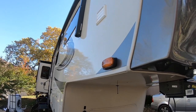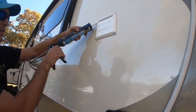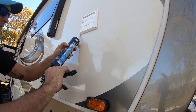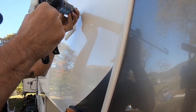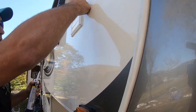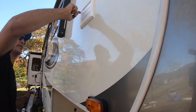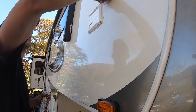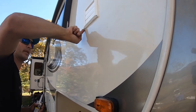We've now secured the outside flange with the four pan head screws. I'm going to take the silicone and run a nice small, about an eighth inch bead all the way around the exterior of the flange, sealing it to the wall and stopping any weather penetration possible. Just take your finger, rub it into the gaps really well — make sure you've got no air holes, any cracks, nothing. Then just take a damp washcloth and wipe off all the residue. The exterior is complete.